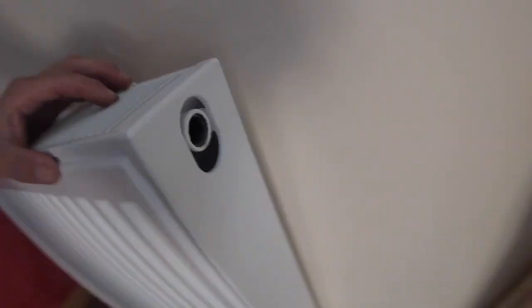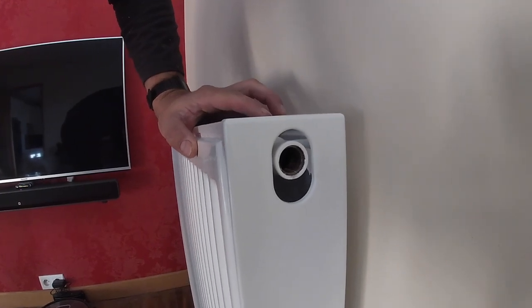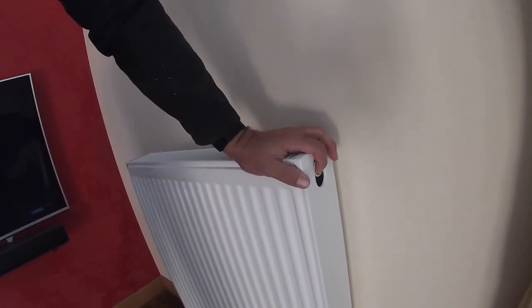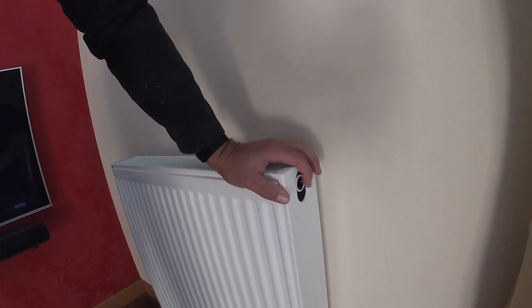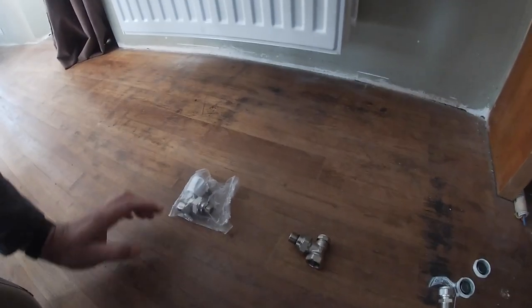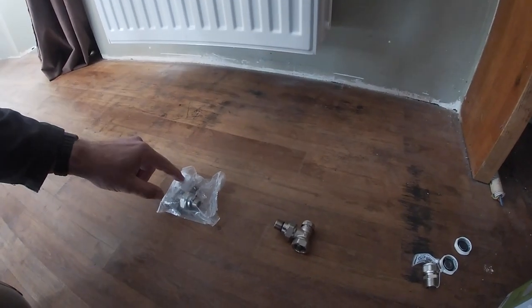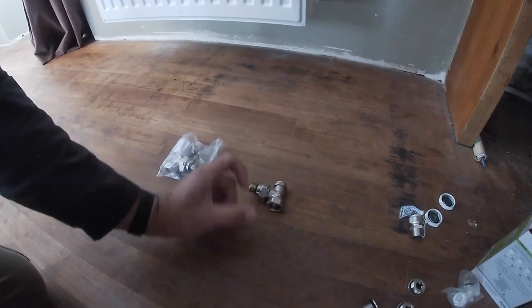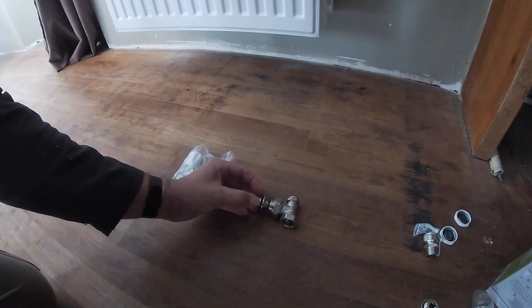The T-piece is controlled by a thermostatic valve, and you end up with a thermostat on the side — quite standard in France. However, that won't fit with my eventual plans, so for the moment I'm going to put a manual valve in and blank it off later. The reason I'm using manual rather than thermostatic valves will become apparent later on. When the heating is turned on, all radiators will be on; you have to turn each one on and off individually. They come pre-fitted with 3/8-inch thread but include an adapter for the half-inch fittings I'm using.